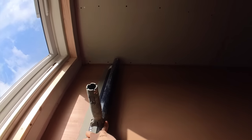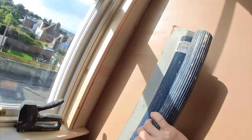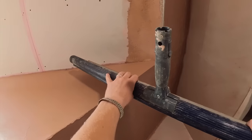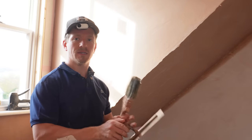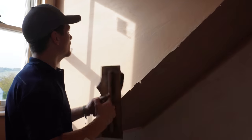That is how you do the reveals. We're going to give the walls a quick flatten with the speed skim, make sure the walls and the plaster around them are flat. Then we're going to carry on and make sure we've got dead tight corners. This bit is fairly straightforward — I'm going to turn on additional light as well because the current light is quite strong on me.